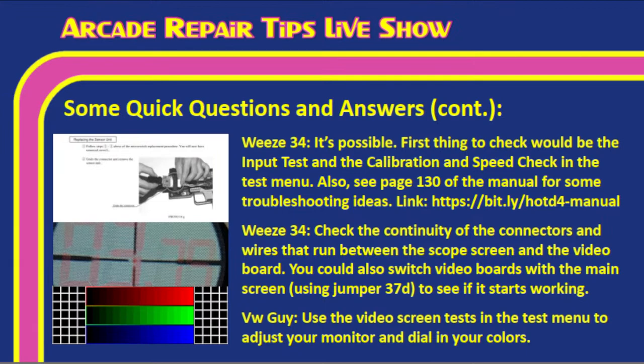The LCD in your scope could be bad, right, Tim? Correct. And so that's what we're looking for with that. So again, let's check the continuity first, though, and then try switching the video boards with the main screen, and then move jumper 37D to see if that swaps the problem or if the problem stays the same. That's what we're looking for.